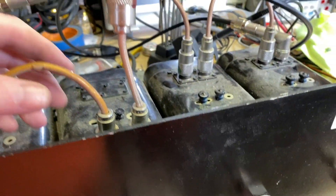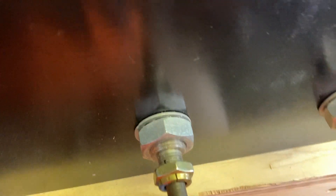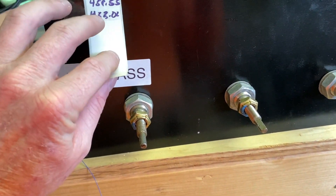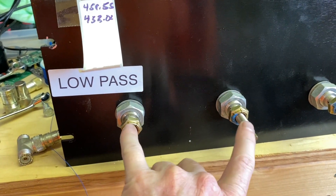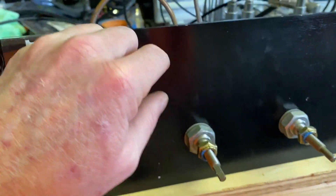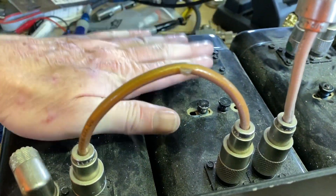I've tuned both of these. As a tip — most cavities, this particular one has a locking nut on the outside of the stem which you need to break loose. You tighten it up and it tightens onto the threaded rod. When I first got this particular repeater, I actually had to move the stem a little bit to get anything through — it was fully attenuated. After moving things around a bit and getting everything cleaned up, my impression is there's probably some corrosion in there, but moving them around freed that up.